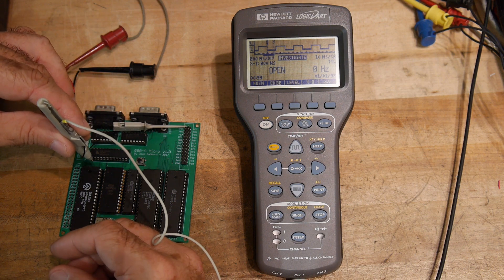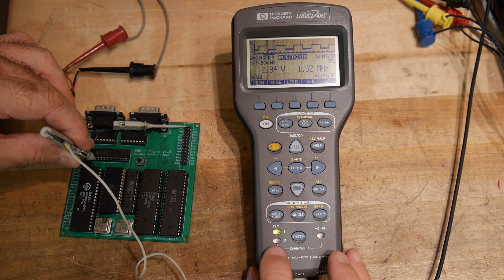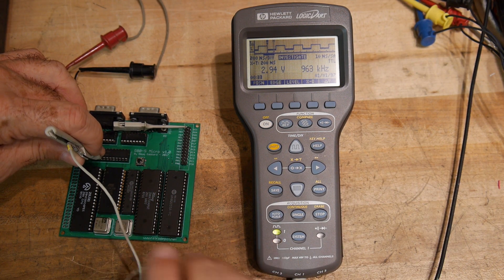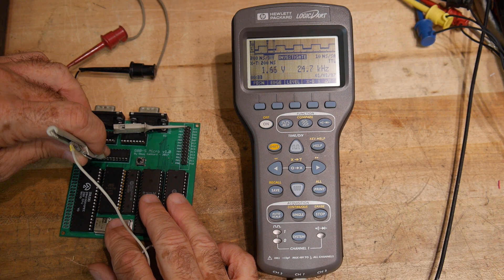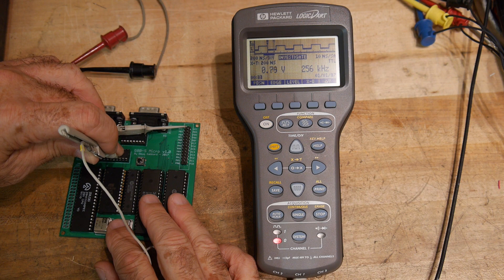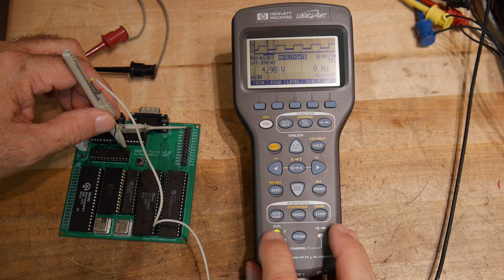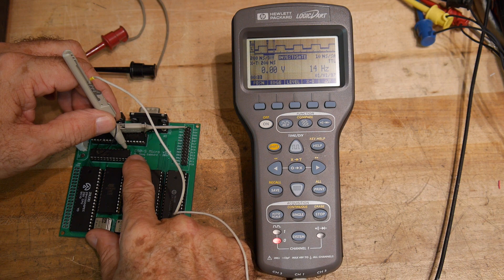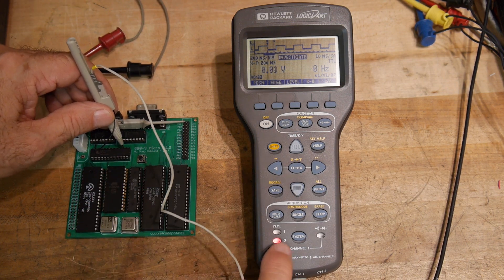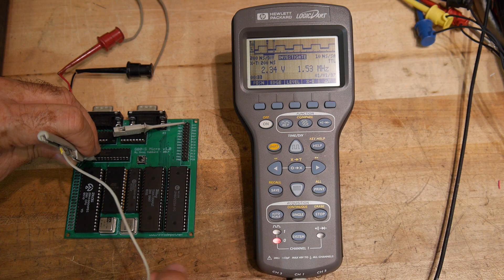We can check logic levels. You can see that we are pulsing logic levels between 1 and 0. That one's pulsing, that one's pulsing, that one's pulsing, that one's pulsing. This one will be steady — it's at a high level. This is the reset line; if I press the button it goes to a low state. And then this is the invert — this GAL part has an inverter, so it's low and then high. We see state — if the state is toggling, it just toggles for us.